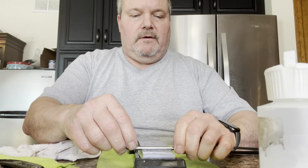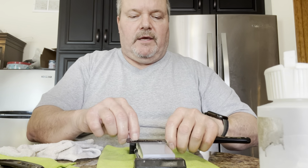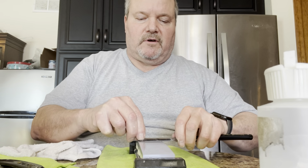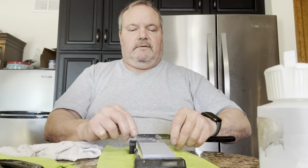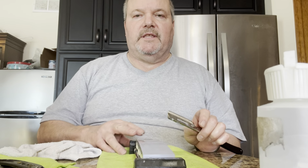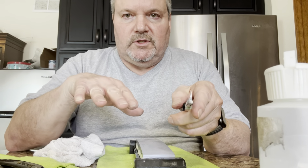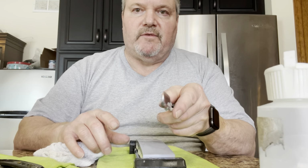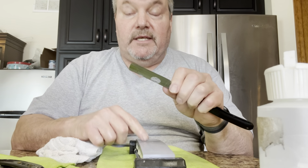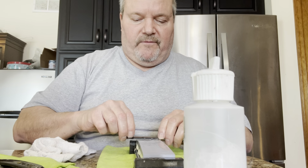I think I've seen where the inventor of the shaping plate does this, he would use these short radius stones first and then go to the longer radius stone. And when you're using this, some of the inconsistencies that the other stones that have the long radius in this direction, where they're compensating for inconsistencies in the geometry, this one does not do that. This one is much more of a flat type of thing.